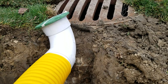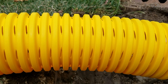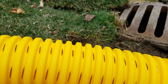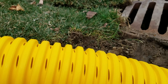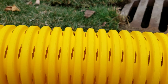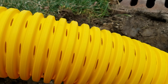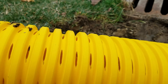I love the PVC conversations. Nothing is more durable in the frost than this corrugated pipe. I'm going to explain why: this pipe can move as the ground moves in the frost — it's not going to crack like a hard PVC pipe. When we do use PVC, we always use schedule 40, but it would be kind of ridiculous to build a yard drainage system out of schedule 40. This corrugated pipe does the exact same thing, and we're allowed to put eight inlets per valley. A schedule 40 pipe usually has a hole or two at the bottom; this has eight holes in every valley, all the way around.